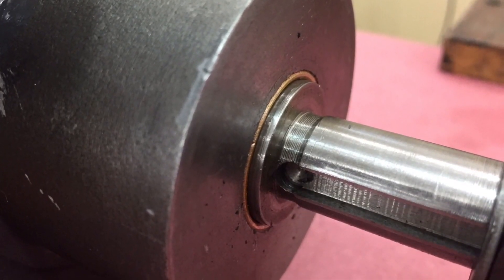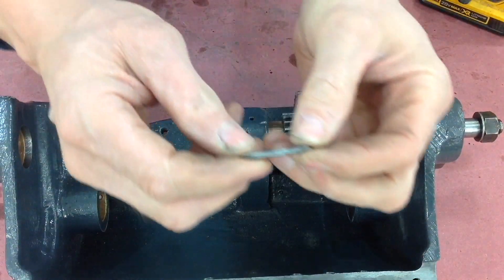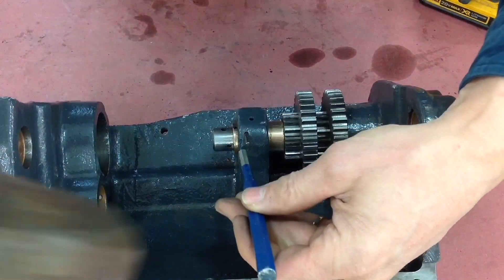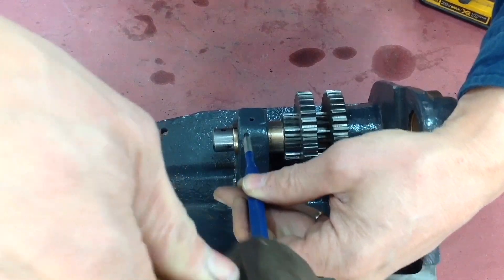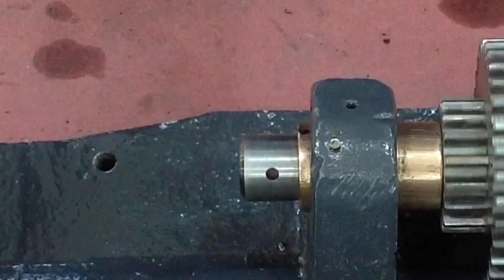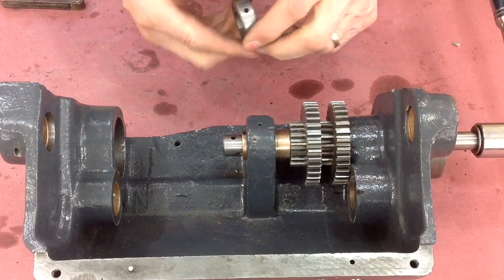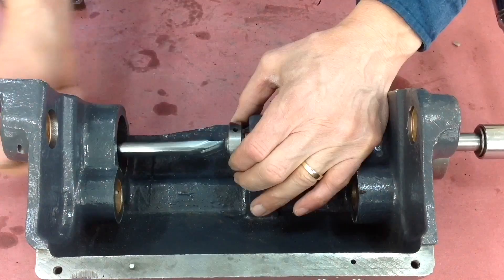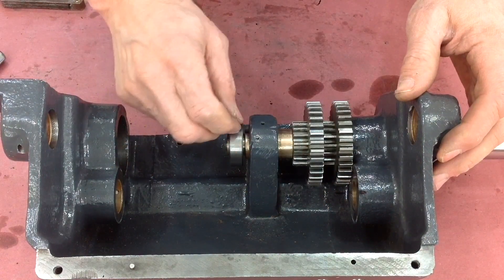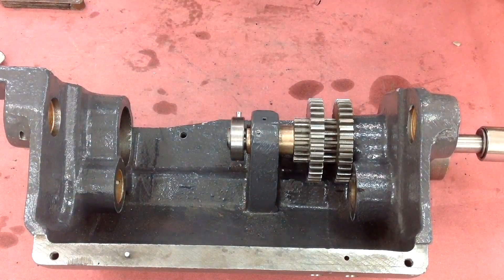There should be a slight shoulder on the outside of the casting for the shaft. Now you drill a hole in the bushing and put this eighth-inch pin into the bushing — it holds the bushing in exactly the right spot and the clearance of four thousandths is maintained for the first two compound gears. Spin the shaft around so the large side of the taper pin hole is up, install the collar, tap it in to get it lined up perfectly, then slide in the taper pin. I did not drive it home yet because there's a chance you've got to remove it, so I waited before driving it in permanently.